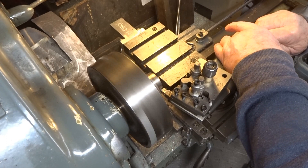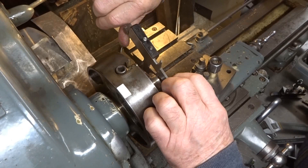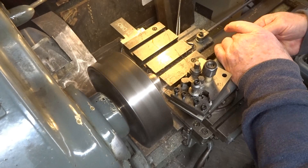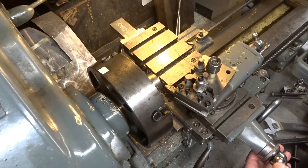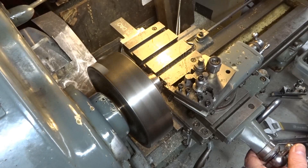This video clip is sped up five times and just shows me turning the tread on the last of the wheels — the fourth wheel — with a three-degree taper, as per the rest. You may notice that rather than rely on my failing mental arithmetic when making parts, I have a tendency to check multiple times where I am with the dimensions when turning.